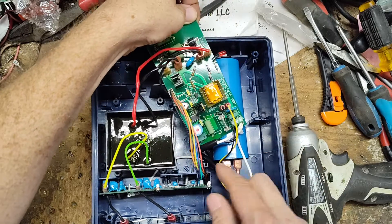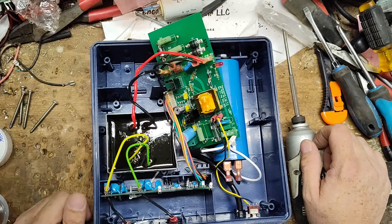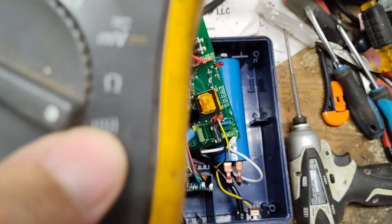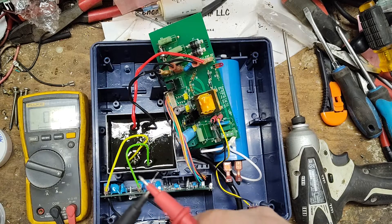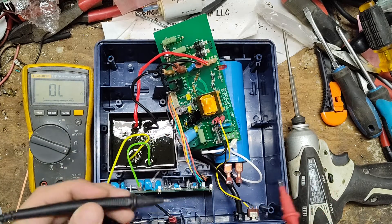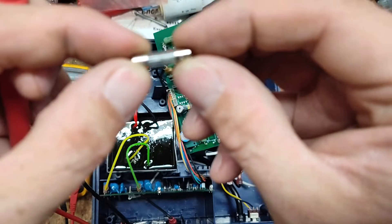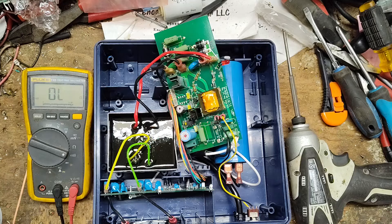The first thing we can do is check that fuse. I don't see anything obviously burnt up just from looking. So maybe it'll just be a fuse — wouldn't that be nice? I'll put the meter on continuity — that little speaker symbol — which gives you an audible tone; if it's good it should beep. Testing across the fuse it looks good, it's got a big thick filament. But wait — the fuse is bad. Popping this fuse out, it's really hard to see, but there is a filament all the way across — big thick filament — yet this fuse is indeed bad.